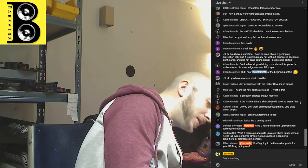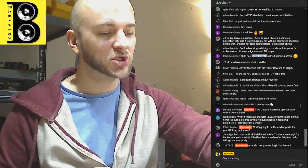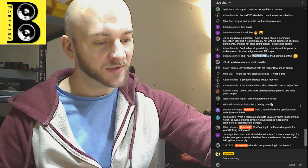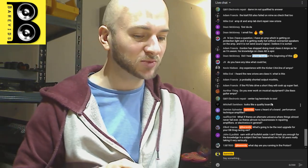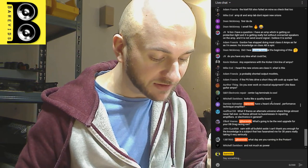But with mains powered amplifiers, because you've got to feed it with, in this country, 240 volts AC, even if you current limit that, the fact that there's such high voltage there means that if there's something still wrong with the amplifier, or something you missed, or a short somewhere, you don't get any time before everything just catches fire. It's so much more dramatic and scary working on mains power stuff than it is car amplifiers. But it might be something that I look into in the future.